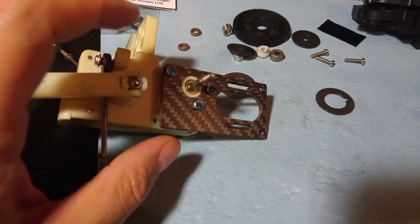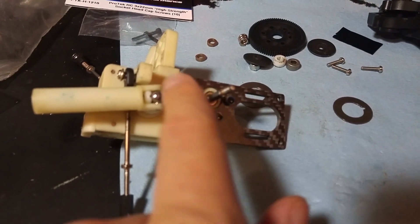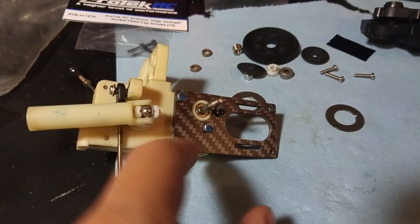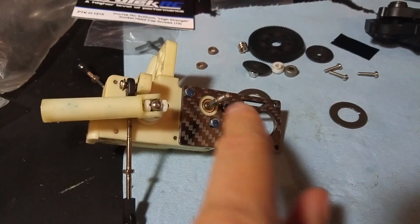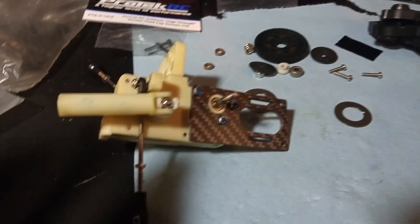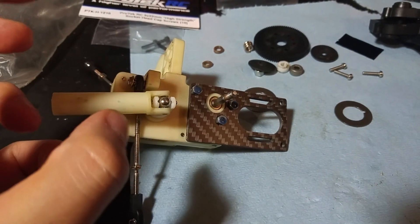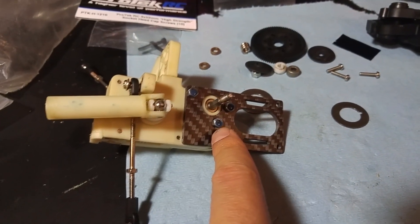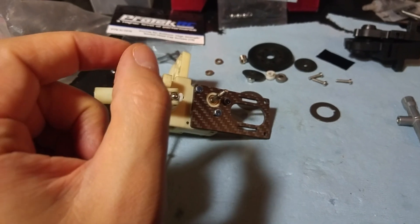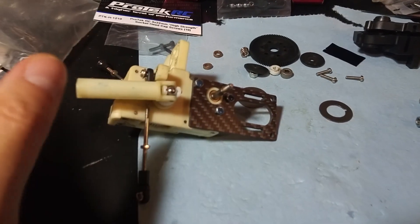I would eventually like to use lock nuts. With the current setup you also need to be careful with how much you tighten the nuts down. If the holes aren't countersunk and you really crank down on the nuts, they'll tighten the gearbox so much that you'll notice binding. This gearbox actually spins very freely — it's a really nice gearbox. Having countersunk holes with one or two more millimeters of room buys enough space to tighten the nuts without causing binding, or to use lock nuts instead.